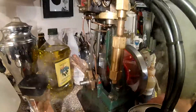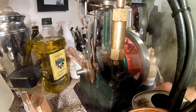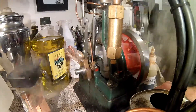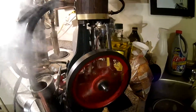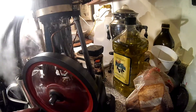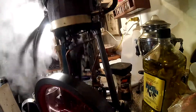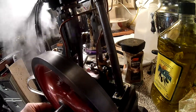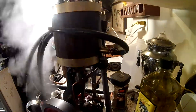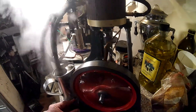Trying not to get burnt here. The crankshaft seems to be running very true. I really didn't spend a lot of time shimming the key here, so I'll probably work on the key. Sounds powerful though. Sounds quite sealed too. There's no water dripping, as you can see, from that large 3/8 piston shaft that runs up there, and no water coming out of anywhere on the top here. So I think my absence has let this engine age quite well.